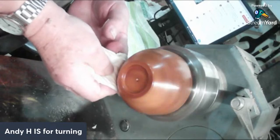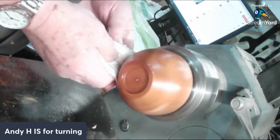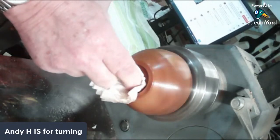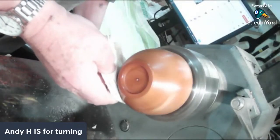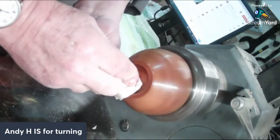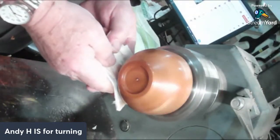I have a bench grinder. It spins at 3,500. Will that work to sharpen my gouges? Rather fast, I would say, Tipsy. Normally they run at about 2,800. Or if you've got the slow one, that runs at 1,400. If you're not careful, at 3,500, that will burn steel. So be very careful and a very light touch if you're going to use that. You can take the temper off it so easily, can't you? Yeah, if you get it that hot. Although some deny that, I must admit. Yeah, the modern HSS, apparently it's hard to pull the temper, even if it gets quite coloured.